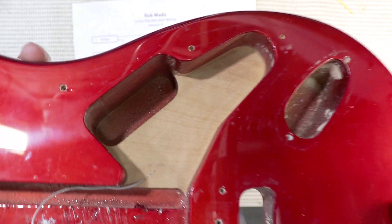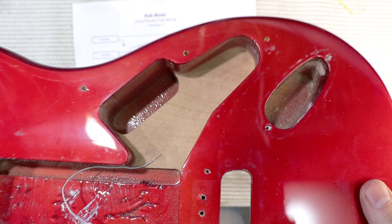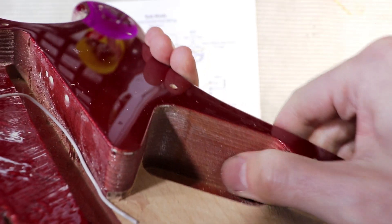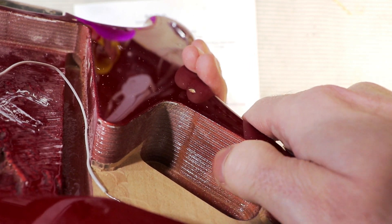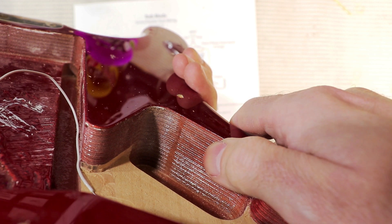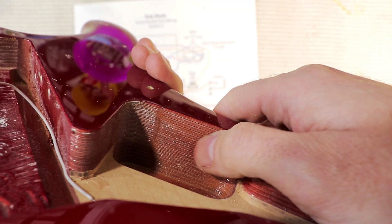It feels too heavy to be basswood, like so many of the Asian-made guitars, and there's a bit of grain there — it actually really looks like alder to me. Again, that seems strange for a budget Asian-made instrument, but tell me what you think. The other interesting thing is just this kind of texture on the sides of the routes. I used to run large wood routing CNC machines in a guitar factory, and this has obviously been cut with a serrated cutter of some sort. I have no idea why — perhaps it's just more efficient with a bit less heat in the cut, and they can crank the traverse speeds and knock the bodies out faster. If you do know, let me know in the comments.